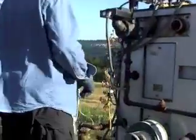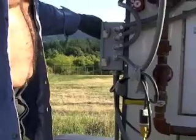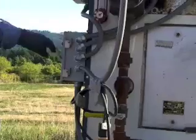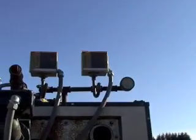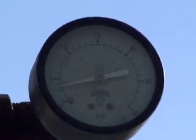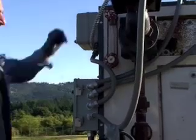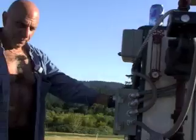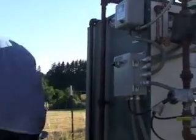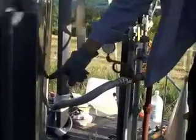I'm going to turn on my feed water pump. As you can see, the water comes from the tank to the feed water pump. I'll turn the pump on now. The feed water pump is adding water into the boiler. We just filled up with a new batch, so we're starting from scratch. You can see we do have some pressure already — we've got three pounds up there. The boiler won't start until we relieve some of that pressure. In order to do that, I'm going to open up the valve on top here. Now we have steam traveling through this pipe, coming down along here, up into this fitting. We actually have water going through this valve right now entering the bottom of the distiller.